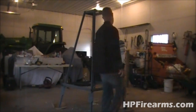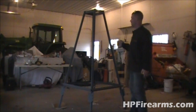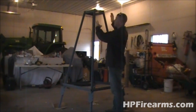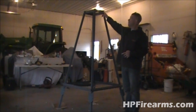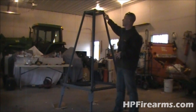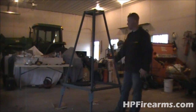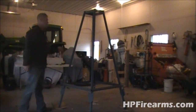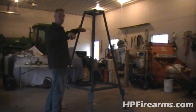Then I repeated the same process and made the second A-frame. Once I had the two A-frames done, it was as simple as cutting another 10-inch piece with a 10-degree angle on it, bringing my pieces in, and tacking the same 1/8-inch by 2-inch wide steel into place. Then I came down, spread the legs on the A-frames, and put another 32-inch bar in. I repeated the same process on the other side, which gives us the same spread on both sides.